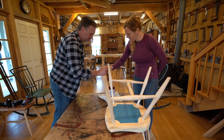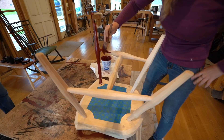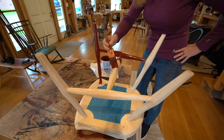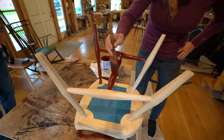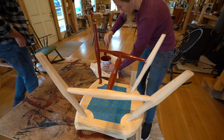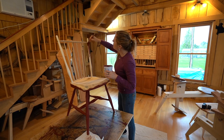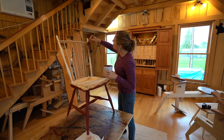Then it's painting time. When painting, there's nothing crazy about this step. The main thing to watch out for is drips — if you paint too heavy in one coat and overlook where it runs, it will form little tear streaks. They can be removed but it's more work, and it's simple to avoid by doing light coats. I would dip my brush, wipe off some excess on the edge of the container, then watch that no area was getting too heavy and running. After getting everything on the bottom side of the chair, I flipped it and started painting the rest.